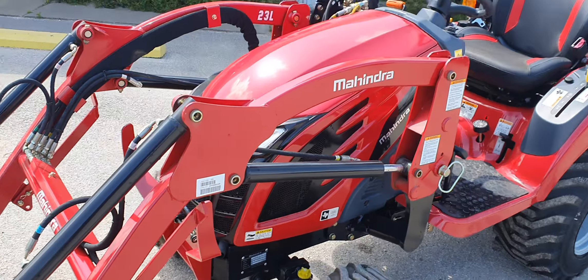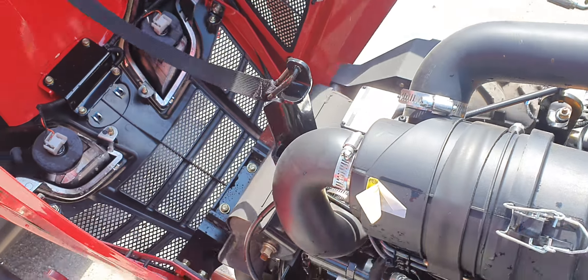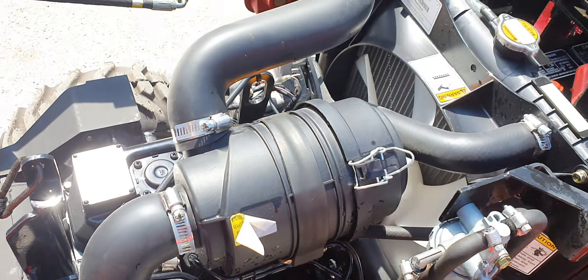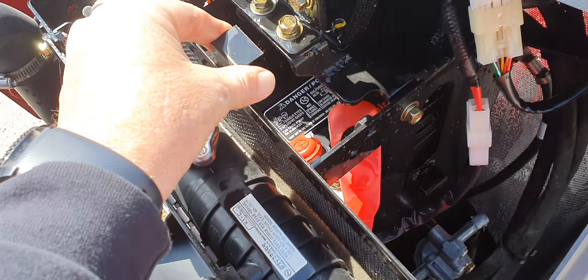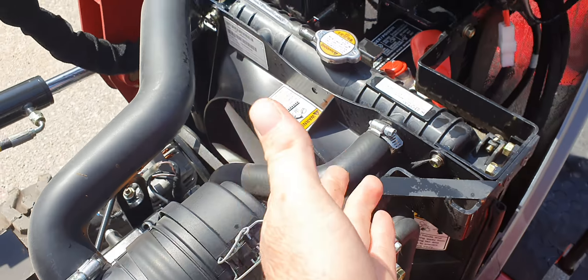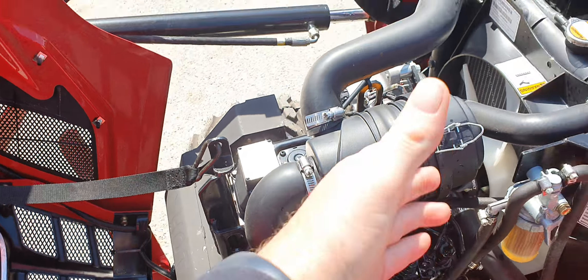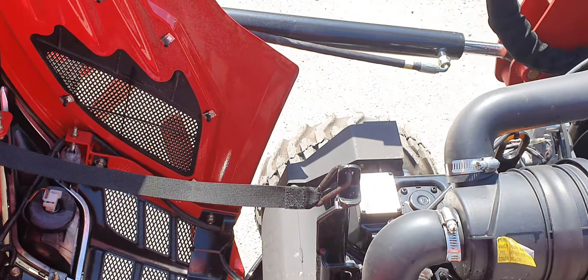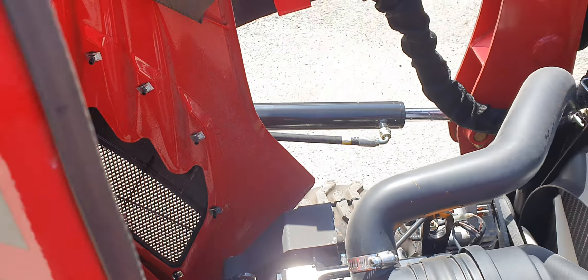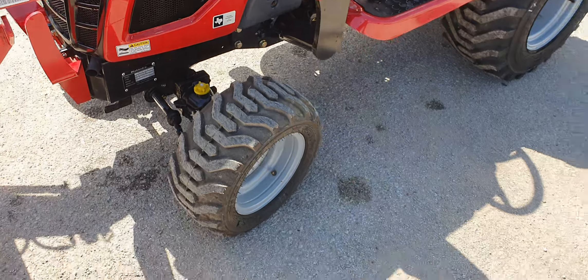You can put the mid-mount mower on here or get a pull-behind finishing mower — we can install that for you. This is a Yanmar engine and I like how they did it. You pull your hood up this way now. They actually turned the engine around, so your radiator is actually on this side and then you have your screen so you can actually clean it out and keep it clean longer, instead of having to get up front where you collect all the grass and have to get off periodically just to clean it out. But please do not wash it out with water while it's running and then get back out there, because you will cake it up.